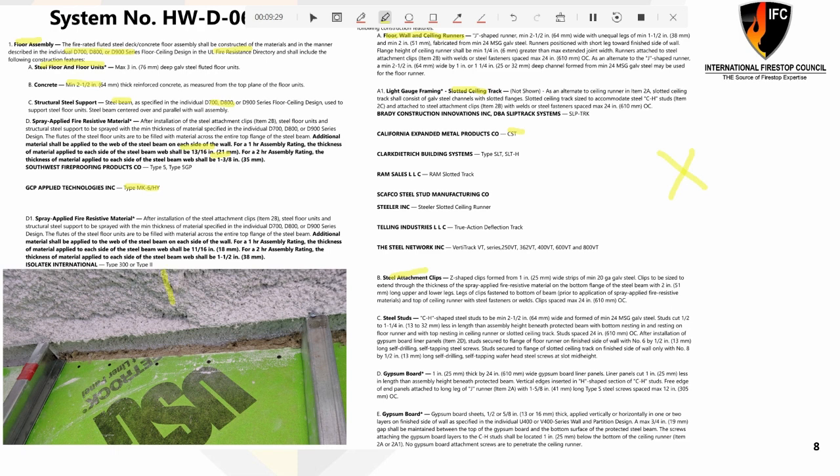The listing will also talk about the Z-clip — how is this wall attached to the beam via Z-clip, how is it welded, shot pin, what's the on-center spacing, and how do we fireproof that element? We're also using CH studs — not a C stud or a CT stud. The specific type of stud and gypsum board is called out. For example, minimum one inch board — so if I have two layers of five-eighths on both sides, this listing would not be applicable. This is specific to a shaft wall. The stud depth, type of stud, the track at the head of wall with its flanges and sizes, and the sheetrock gypsum type and thicknesses are all called out. Very specific to the wall and floor construction.